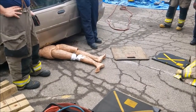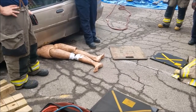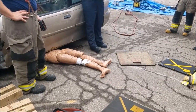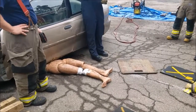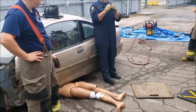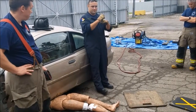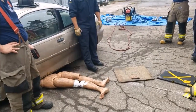You can stack as many as two bags together. Always put the smaller bag on top of the bottom bag, and always inflate the bottom bag first. Generally what I do when trying to get a lot of lift is inflate the bottom bag to about 75% of capacity, then start inflating the top one — it kind of locks them together. If you over-pressurize the bottom bag it's rock solid, and as you pressurize the top one it gets a little more unstable. If you kind of chase them like that it generally works a little bit better.